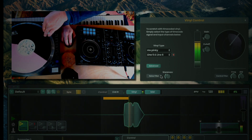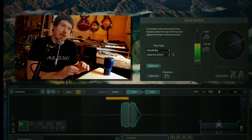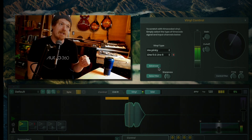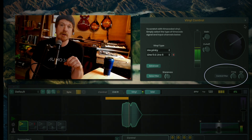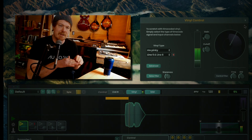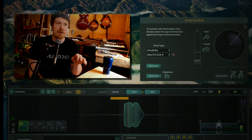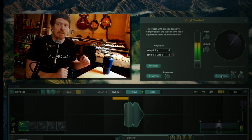Once it's fairly stable while stopped, try moving very slowly — this is test number two. When the turntable is moving very slowly it also has a very low signal-to-noise ratio. If you move slowly and don't see the turntable moving, bring the cutoff down a little bit, and try taking the noise filter sharpness up a little. Additionally, look at the control filter — if you're moving very slowly with the control filter off, it'll kind of bump forward every once in a while, stopped then move a little. Turn the control filter on and it will smooth out the response so that moving slowly forward gives a smooth forward motion, and the same going backwards.